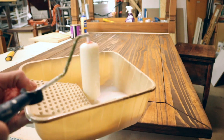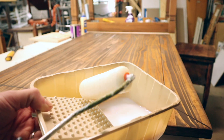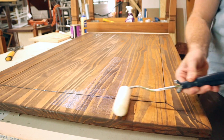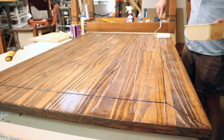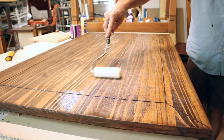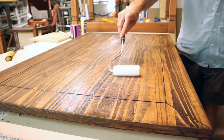So we're using a foam roller — that's my first thing I would say is probably a bad idea. This poly acrylic, I haven't used it very much in my career, but from the times I remember it gets very bubbly. I'm putting it on here doing the mowing-the-lawn thing, half-lapping as I go. I want to note that this was about 75 degrees with 50% relative humidity, which is about as perfect as it gets for finishing.